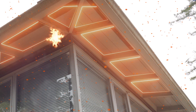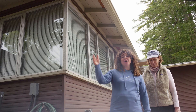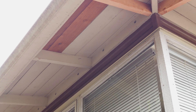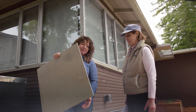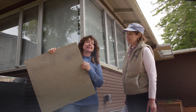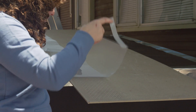The heat buildup can ignite under the eaves and will move into the attic, spreading quickly to the roof. Notice these small holes up here? These are to ventilate the attic. So to fix the risk, we're going to enclose these eaves with heat resistant material. We've chosen fiber cement paneling with pre-drilled holes to allow proper ventilation. We add a 1/16 inch mesh of metal behind it to ensure no embers can penetrate the ventilated holes.